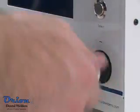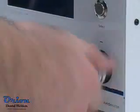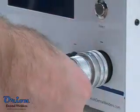The PulseArc welding stylus requires the most attention during setup. Push the connector into the Orion front panel and screw it down. Push in the connector again and continue to screw it down. Finally, push the connector in until you feel it bottom out, then screw the connector until it is firmly seated.